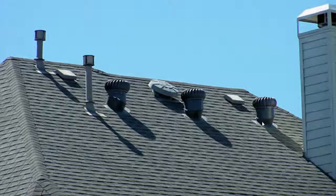But there are all these other areas that are causing a problem, and these can cause the chimney to leak as well. As you can see, the flashing is exposed on the outside and it's nailed down — that will cause leakage to the chimney area. The shingles should have been overlapping the sides, and there should not be nails penetrating through the middle of the flashing. We need to remove the shingles around all these penetrations because they all have nails going through the flashing.